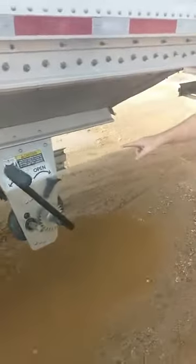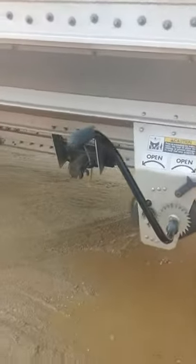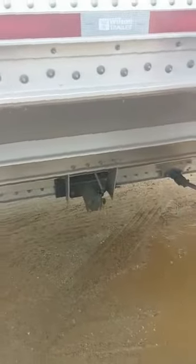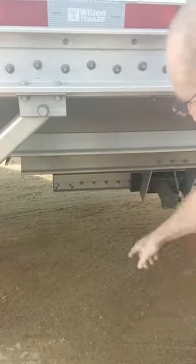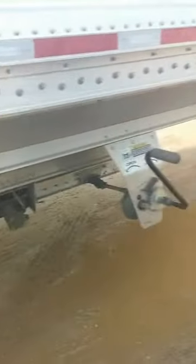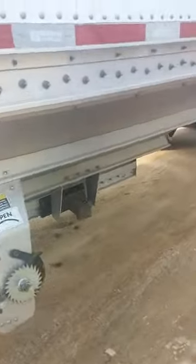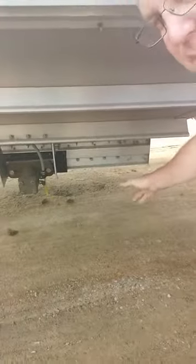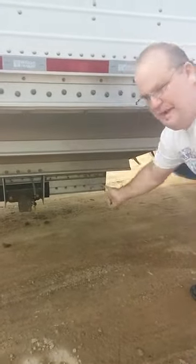The track for the door is on the back here, which means it's going to open from the front. So when you unload the front hopper, you want to make sure the gate starts on the ground right even with that. With the back hopper it's the opposite — the track opens to the front, so you'll want to start the back edge of the gate on the floor where the grain goes, because it'll go back forward.